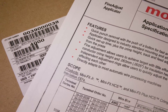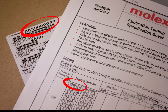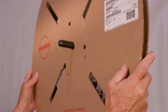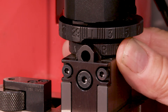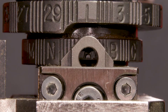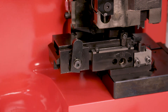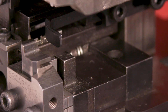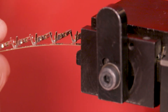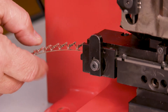To make sure that the terminals and applicator are designed to be compatible, compare the part number on the terminal reel to the compatibility chart in the ATS for your specific applicator. Mount the terminal reel to the spindle. Recheck the applicator cam settings and adjust the insulation crimp cam to 1 and the conductor crimp cam to A. Rotate the drag release so that the drag frame is in the upright position. Push the terminal strip until the first terminal comes to rest centered above the anvil. Check that all parts slide and engage without any interference, and do this procedure several times.